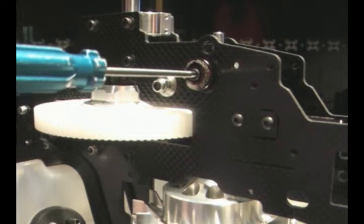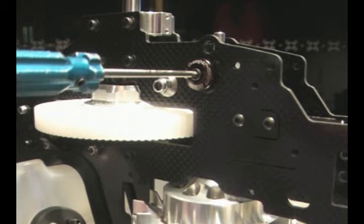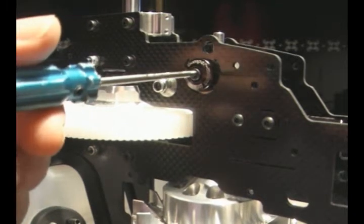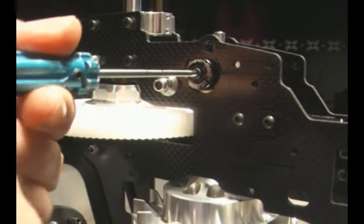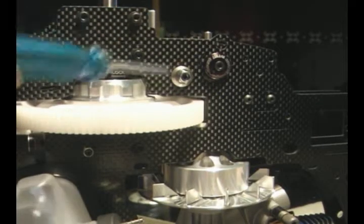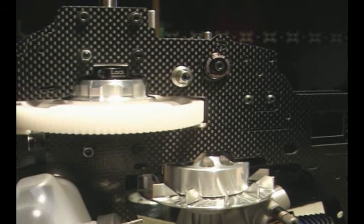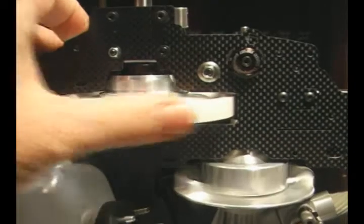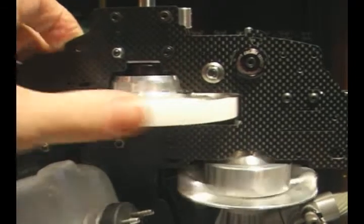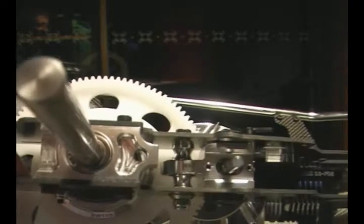So initial pressure there, half a turn, and there's still a little bit of excess there that I could increase the pressure on the damper if I wanted to. And once the M3 bolts have been Loctited in, just over a half turn, we can then do up the M4 lock nut. Once that's secured, make sure the starter shaft runs round nice and freely without any binding, and that's the appearance from above.